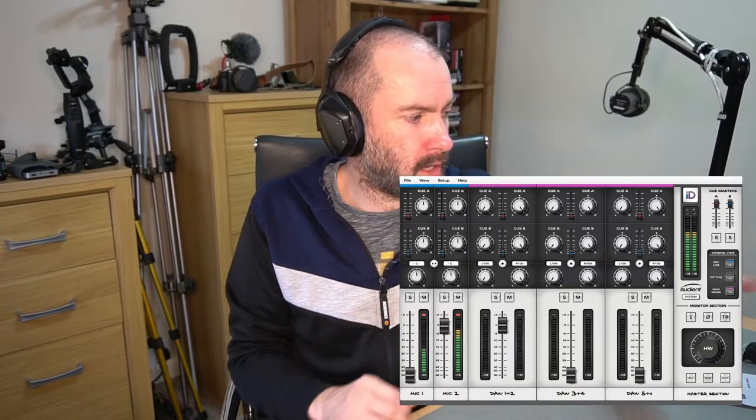I still have to play with the audio levels. But you can see what has happened: the Fethead Phantom has given me officially 18 decibels of gain. I've put it down by about 15 decibels and I'm getting the same levels as previously, but I have significantly reduced the noise floor. Before, to get this level of audio from the Sennheiser 416 I was getting a lot of background noise — but now I don't, and the levels are bouncing around nicely. The Fethead Phantom is doing its job.